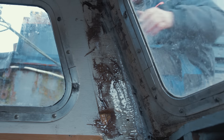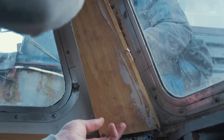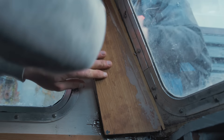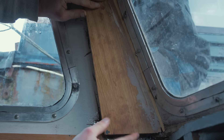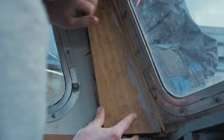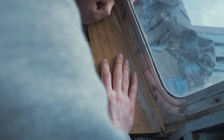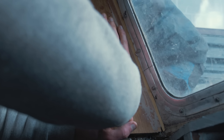I held up the new teak supports for my father to pre-drill and countersink through the plywood on the far side. I applied a thin layer of neat epoxy to the plywood so it would soak in a little, and then applied thickened epoxy using microfibers to the actual teak itself — that guarantees a super strong bond, as well as using screws to help with that.